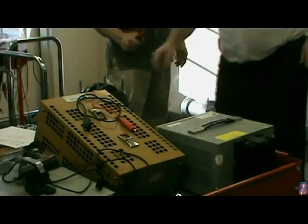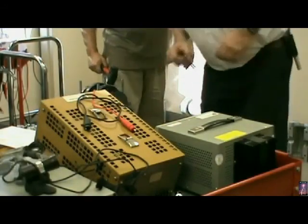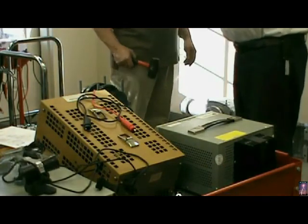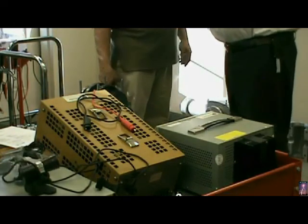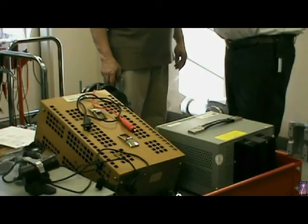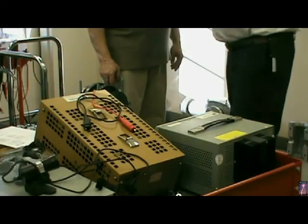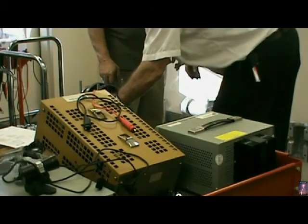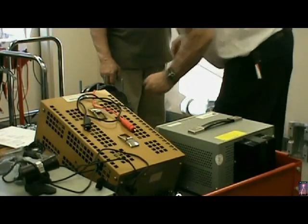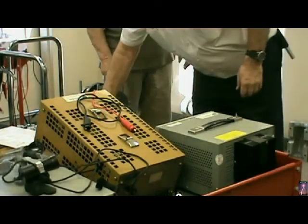Yeah, use your steel hammer. Whenever you find one, you can't make a mistake, because you can't erase it. All you do is grind it off. Make sure you got your letter the way you want it. I got an 8 here, so that's gotta go like that. And when you hit it, be sure it's square on the surface. If you got a little bit of an angle, you're gonna get part of a smile. So I'm gonna give it one good little whack.